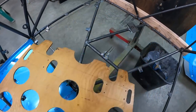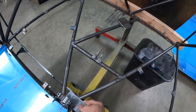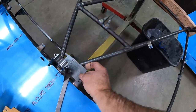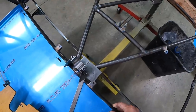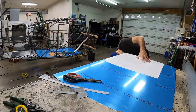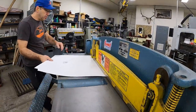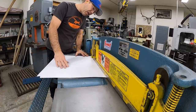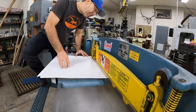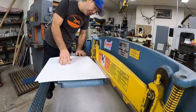Now I'm going to try to figure out what this angle is. I've got this little angle-finding tool, so I can just eyeball it for my cutout. Looks like it's about 22 and a half degrees. You can actually use the shear for shearing paper. I have my shear on the pallet it came on because I move it around throughout my shop quite a bit — it's not ideal, it's actually better if it's bolted to the ground.